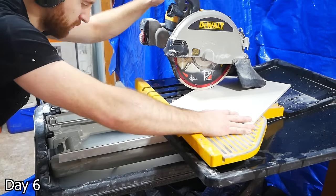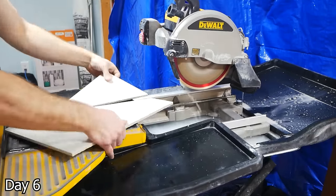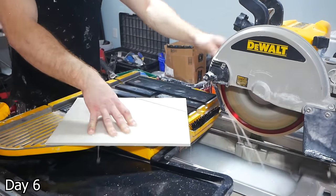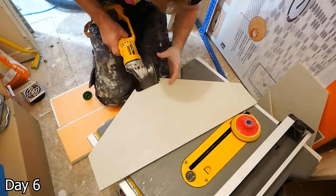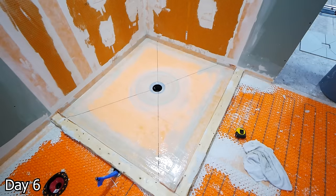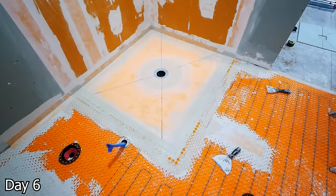Canadian winters mean cutting inside, so we just set up a little waterproof booth — a nice plastic drop sheet and then a couple of moving blankets over top to absorb any water that does get out of this saw. As far as the cuts go, just draw a line and mark the start and end of the blade, then do a couple pass-throughs to get a clean cut. For the more intricate cuts like this drain, using a grinder and then a cone to get all of the nice rounded corners for the drain grate. We want a really sharp finish on this thing — a nice clean look. Any of the cuts that will be exposed, we polish up with a polishing pad. We don't want any sharp tile edges on the shower floor.